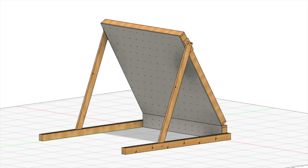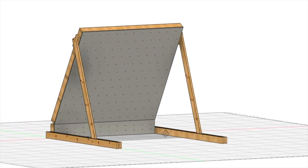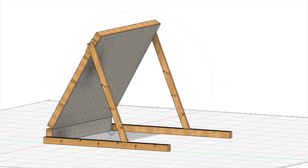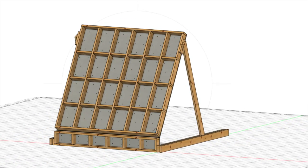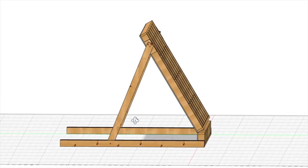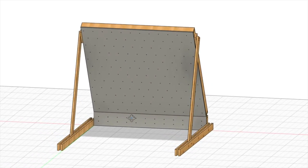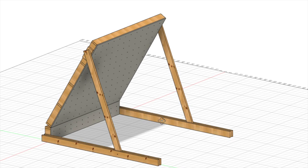So before we jump into the build, I want to take a look at the concept I designed on Fusion 360, which is free to use, by the way. You'll see the vertical kicker board with the angled wall on top of it there, and the diagonal support arms on either side. One change I made is that I actually used two on each side, so two 2x6s sandwiched up against each other to support the angled wall. And then here it shows 16 inches on center for the framing in the back, but I actually did closer to 24 in the actual build. And then we also don't see that horizontal cross brace that will go on the ground parallel to the wall, which I'll talk more about in the build videos.